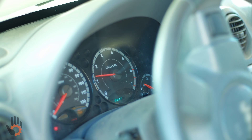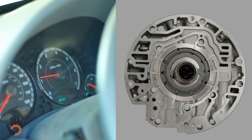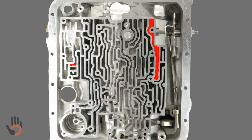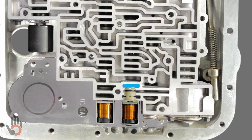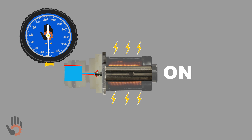When we fire up the engine, the 4L60E pump rotates at engine speed, causing the pump to simultaneously suck fluid in and push fluid out. The oil is routed through the pump and pushed into the transmission case where, with the help of the separator plate, the oil moves back and forth between the transmission case and the valve body before ultimately coming into contact with the shift solenoid. Whenever the engine is running, oil is continuously fed to the shift solenoid. Seeing how the solenoid is energized and the internal valve is closed, this oil has nowhere to go — it's trapped — and as the oil becomes trapped, it starts to build pressure. With the trans in park and the engine idling, you could expect to see a pressure of right around 55 to 60 psi.